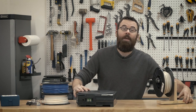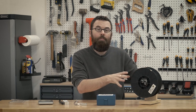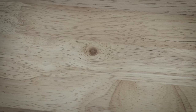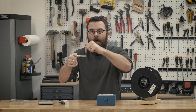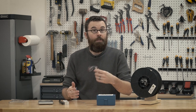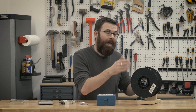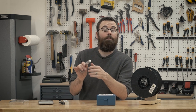What I'm going to do is more of a weight-based system — actually weigh the spool to determine exactly how much filament I have available. I accomplished this by building a filament spool holder that has a load cell integrated into it. A load cell is a sensor used for measuring weight or load. When you affix one side and apply a weight to the other, you read that into an amplifier and determine how much weight is being applied. We set the spool on there, read the weight, back out the weight of the spool itself, and that determines how much filament we have for printing.